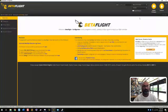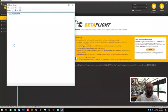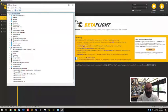And here's what we're gonna do. We're going to unplug our controller, okay? We are going to hold down our DFU button again, and we're gonna plug this back in. Let me make sure that my device manager, I like to watch when it gets plugged in. Okay, first thing I'm gonna do, let me just plug it in regular, make sure our regular driver's working. So we're looking for the COM port, which should be popping up right about here, and there it is. Okay, so we know that driver's loading, so now I'm gonna unplug it.